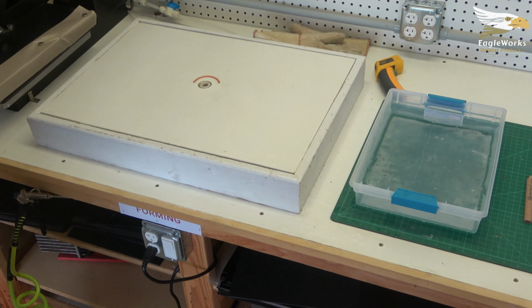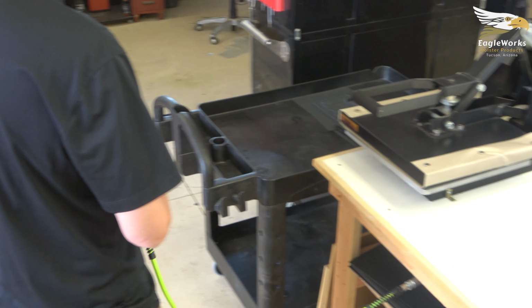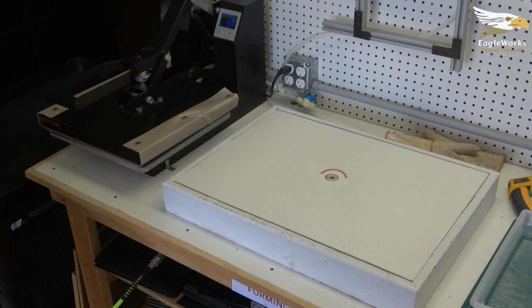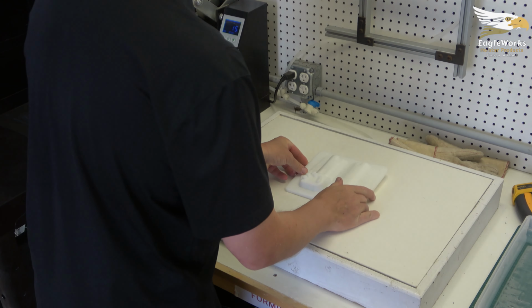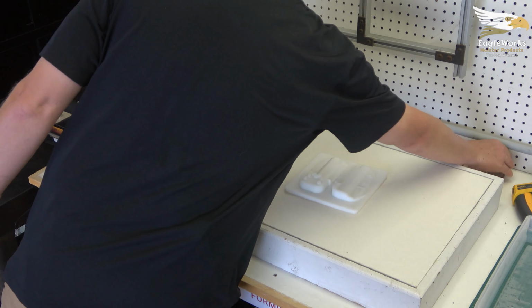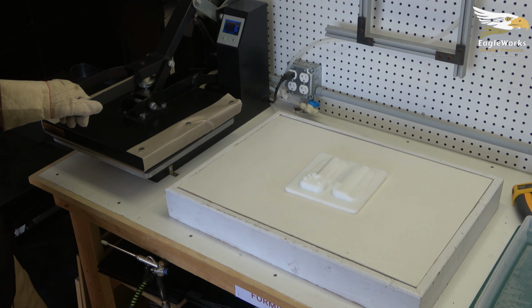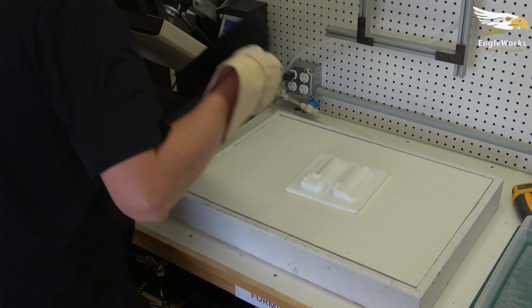In this production run, several shells will be formed using the same mold. This process repeats until all the holsters in your production run have been formed. The limiting factor for speed is the time it takes the Kydex to heat up. In our shop, that's 110 seconds. So a holster can be formed every 110 seconds.